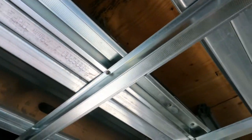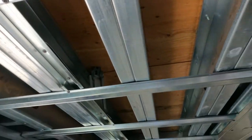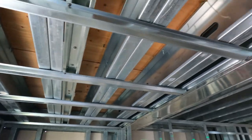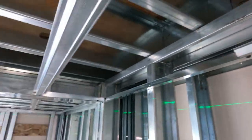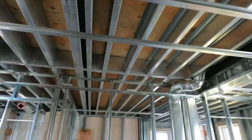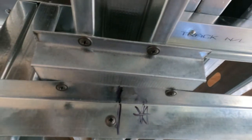I'm showing you the hat track. There's going to be plenty of examples coming up in the next few videos, guys. If you are doing ceilings, you definitely want to be subscribed to the channel because there's a lot going on here. This is super tight — you can see we're not screwing it into this floor joist at the end; we're just letting it hang and screwing it into the angle. This is the piece of hat track for our bracing. Bracing has to be within four feet of the structure, so outside your bulkheads, you go every four feet — and if you can make it tighter, go tighter.